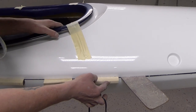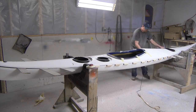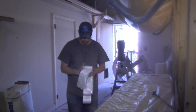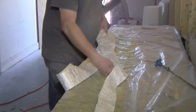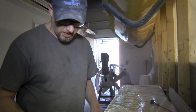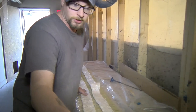What that does is it helps me shape the boat, set the shear of the boat, and then I can put my inside seam on the inside and that holds the whole boat together. This is the inside seam — it's nine ounce biweave on the outside with a layer of chop mat on the inside. The chop mat gives it superior adhesion and means we don't have to use as much resin. This is what holds the boat together basically.